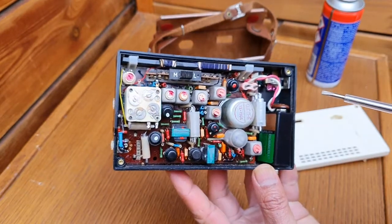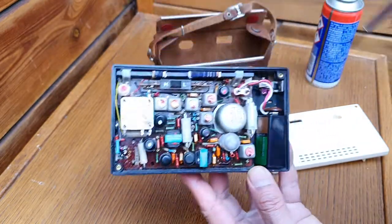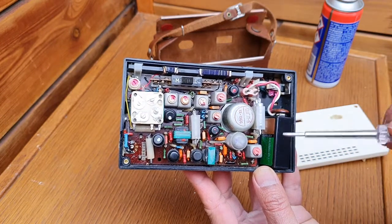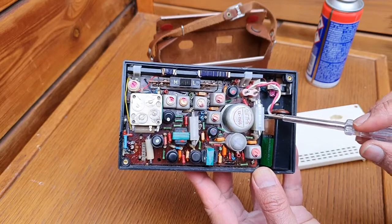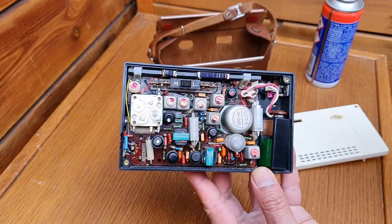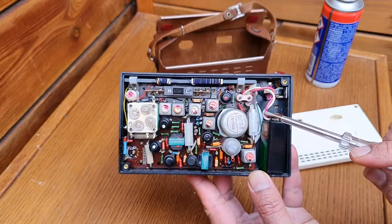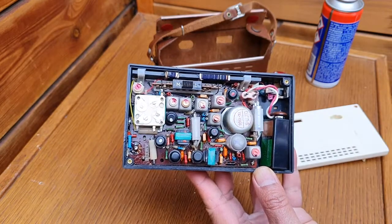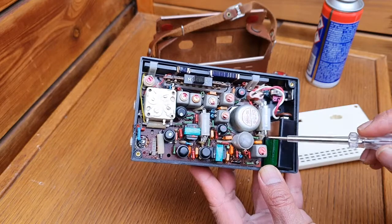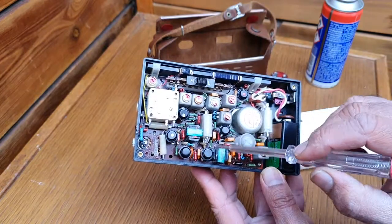It's quite a novel way to reduce 220 volts down to 9 volts DC — they have used high-voltage resistors. In Japanese and Western designs they were using step-down transformers, but what they did here is use high-voltage resistors to drop 220 volts down to nine, and then a bridge rectifier converts it to DC voltage.